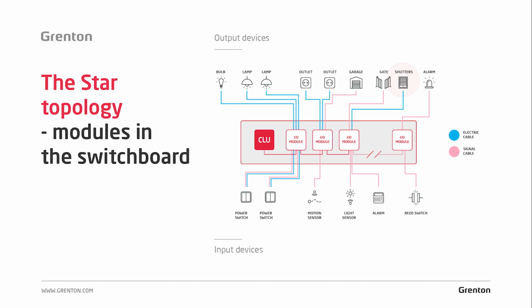How to wire that switch? Exactly the same as the other elements were wired, i.e. a wire is led from the switch directly to the switchboard. It's not acceptable to connect a switch to the roller shutter in parallel and control the roller blind directly to the controller.